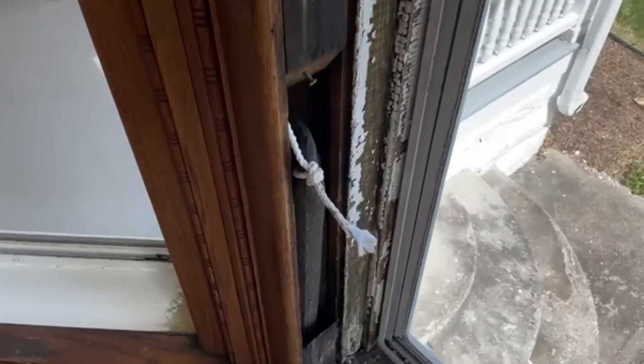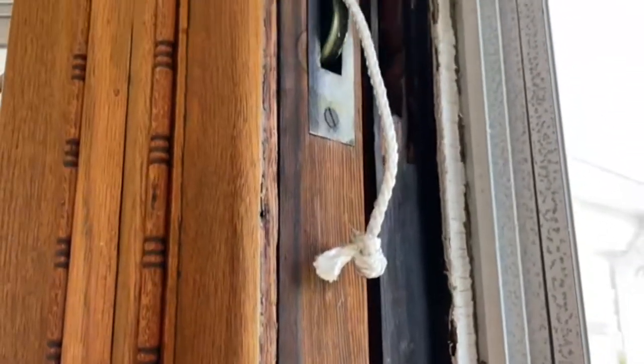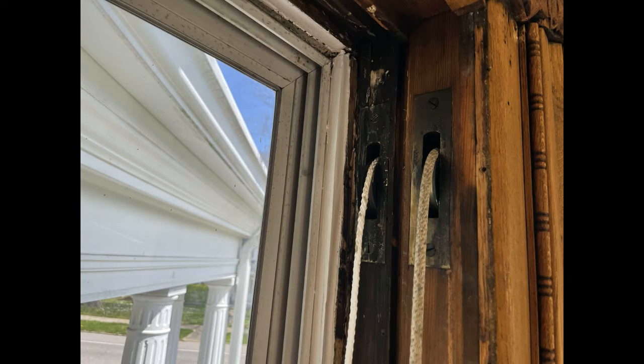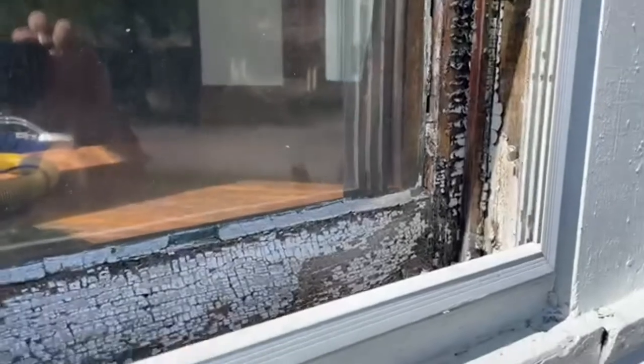When you have a project like this, it really is like opening a can of worms. Many of these windows had lost their counterbalance rope — that weight is there to counterbalance the window and make it easy to go up and down. These ropes break over time, so I had to restring quite a few of them. A little WD-40 on the pulleys and now the windows operate really smoothly in their channels — as I like to say, they operate as designed.